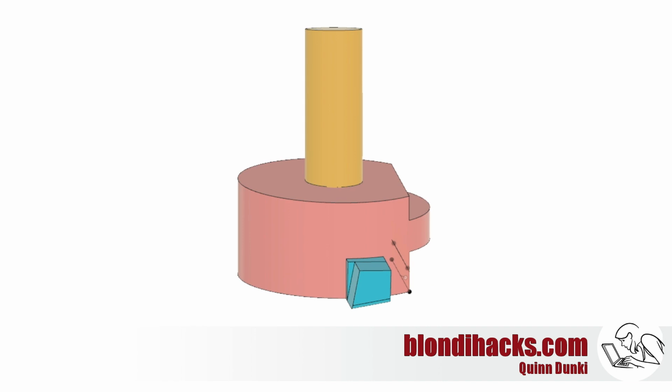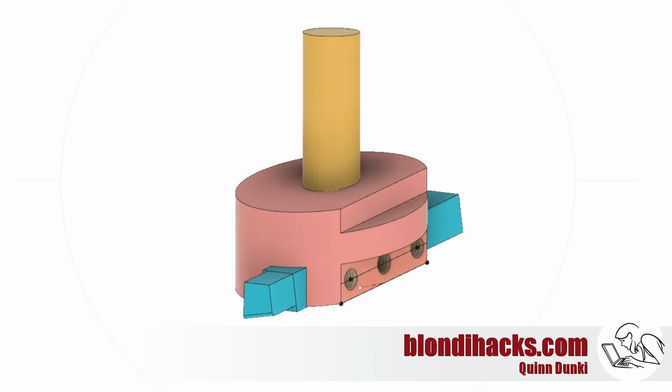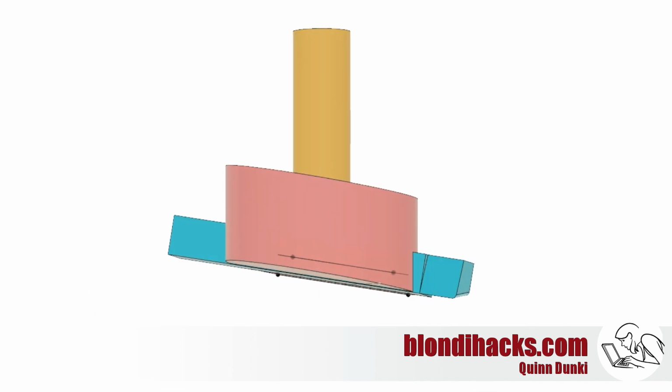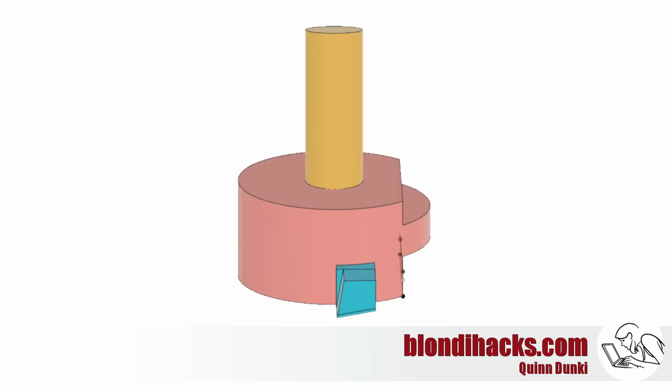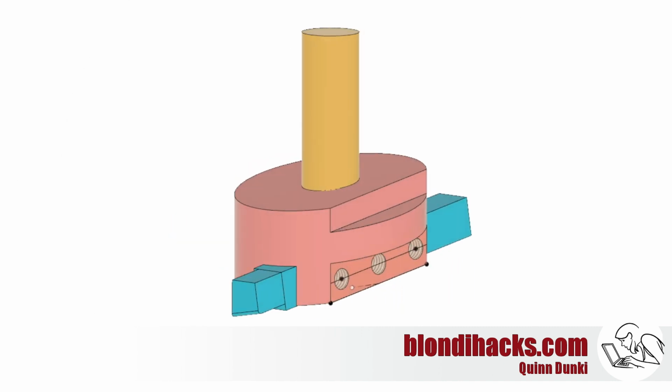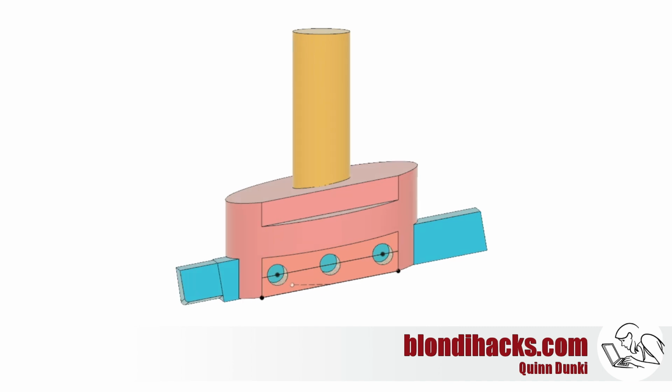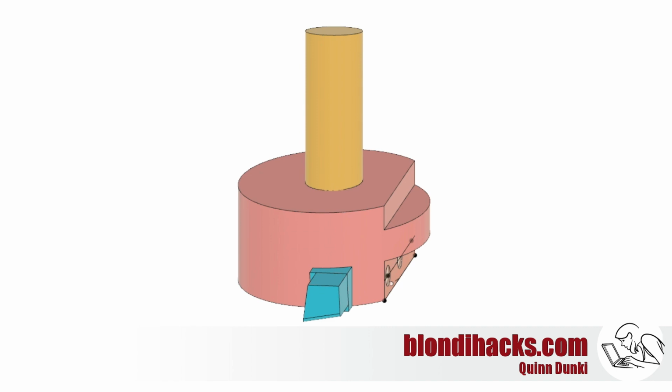And of course, nowadays with car wheels, we do dynamic balancing, where you put the wheel in a machine that spins it at an approximation of road speed, and then the computer calculates based on the wobble of that wheel where to put weights and by how much. So with a dynamic balance, we could theoretically make this fly cutter perfect, but a static balance is going to get us most of the way there and should hopefully perform better than your average wedge-shaped fly cutter.